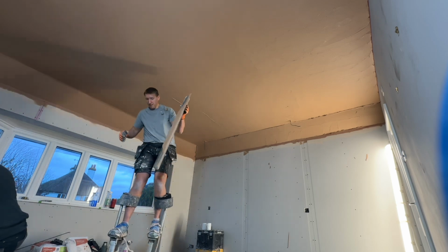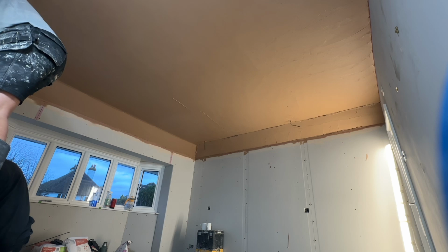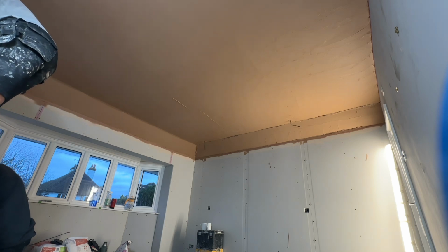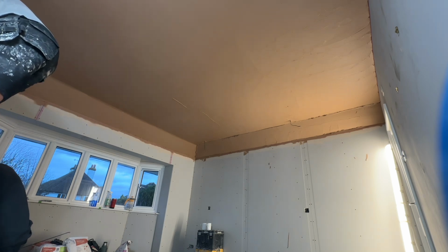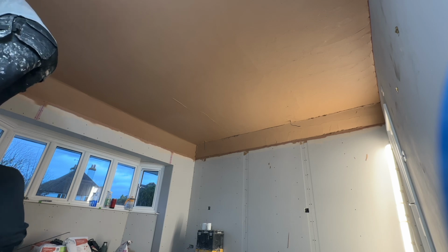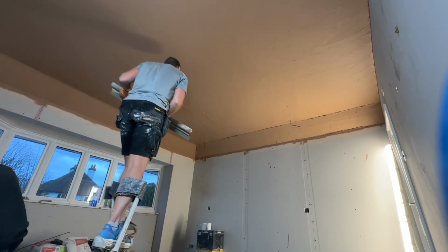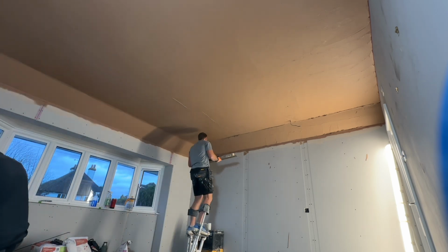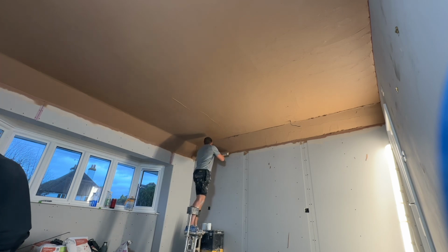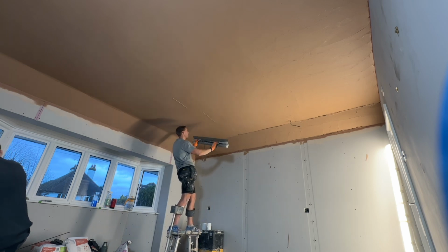And that, rather than using a 14-inch steel trowel, the 4-foot speed skim is a little bit more forgiving than a rigid steel straight edge. So it will follow the curves a little bit, but while also flattening and straightening it out. So I quite like this method for doing the curves. You can use your steel trowels. Some people like using flexible trowels, which, nothing wrong with that.